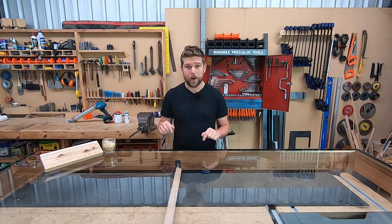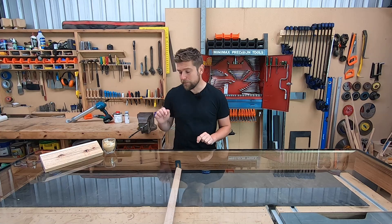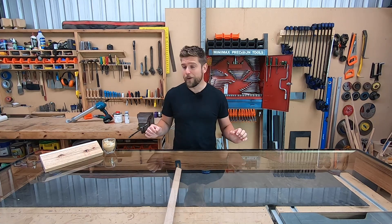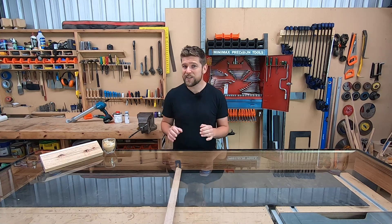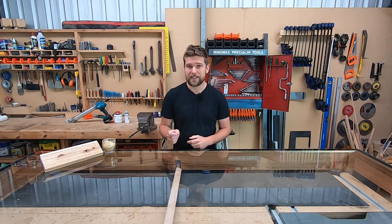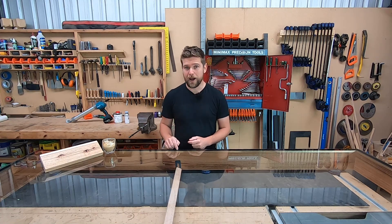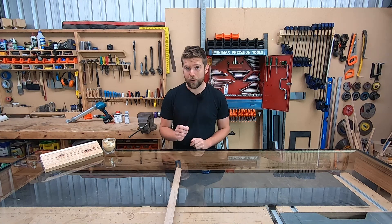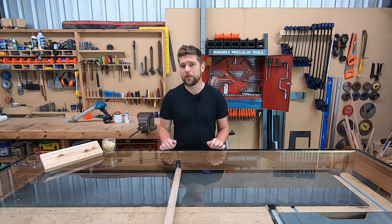The problem was when I was talking to Sika, who I ended up using for my adhesives, they said the primers are organic and will also break down. So while they would hold for quite some time, within about 10 years I might be looking at redoing it, which I really didn't want. And then when I dug a bit deeper, it turns out sticking to brass - which I've put on all my pieces of timber - was a problem. In fact, it would react with the polyurethanes I was looking to use.